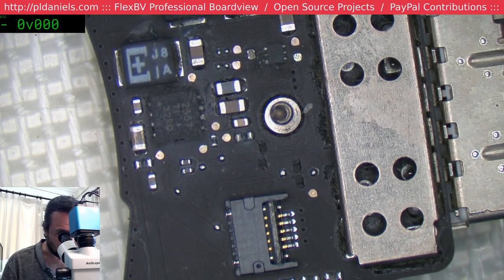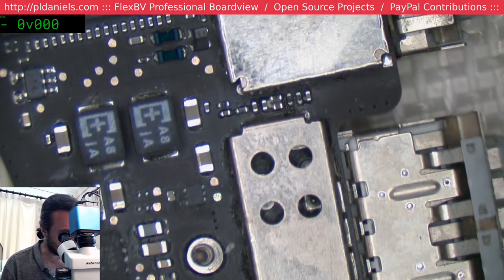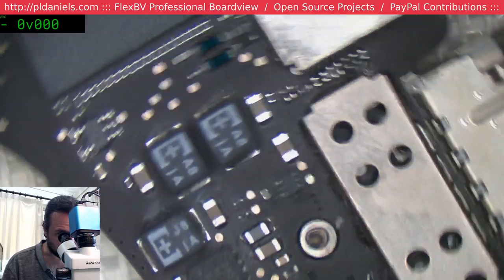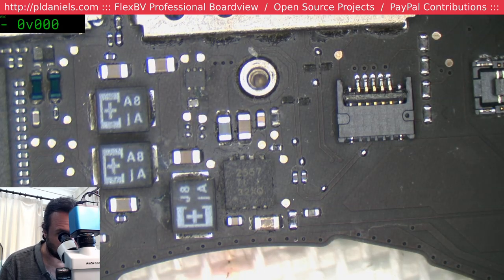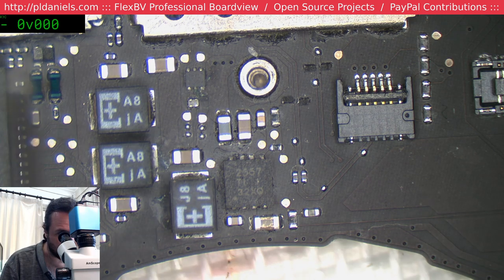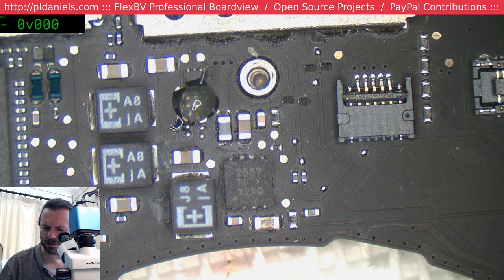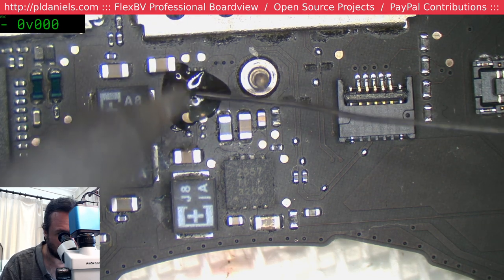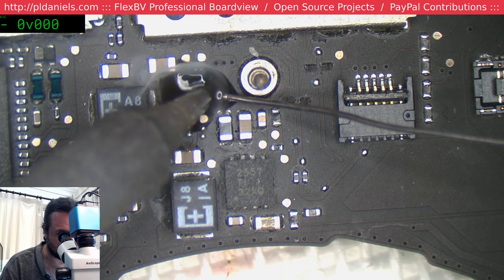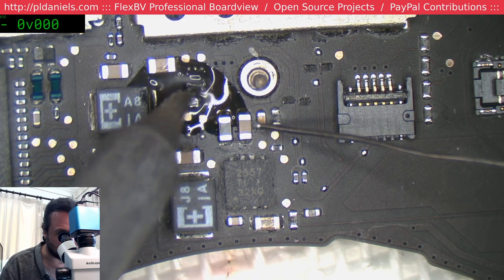We're talking about old computers. My first PC was an 8088 with the typical turbo button on it, so you had 4.77 or 10, and I had a 20 megabyte ST225, or was it ST255? Anyway, I had one of those in there, the old MFM drives. I wasn't rich enough to have an RLL one, although I did covet the RLLs a few times.